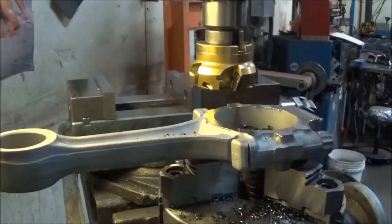And on that note too, as far as quickness, some of you may be looking at the speed and feed of this thing, and obviously I've got this big gnarly face cutter here. It's capable of a lot more material removal than that, but we've noticed that if you really hog these things out, the bit life suffers a whole bunch. It's not like a CNC machine where you have flood coolant and can have a lot better tool life. Doing it on a manual machine like this, sometimes you have to make a little compromise, but it's not that big of a deal. It doesn't take that much extra time, so you've got the process there. So we'll go ahead and do the other seven, and then come back and do the chamfers.